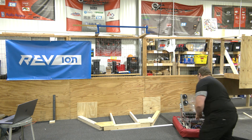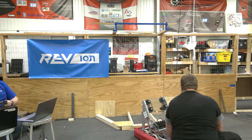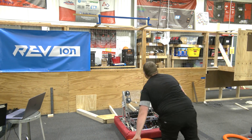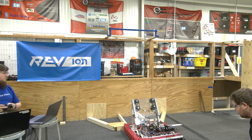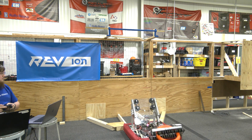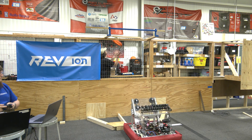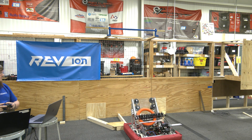So now we're going to move the robot to the front. We're still maintaining 60 percent shooter voltage. We found that this power across all sides of the subwoofer does just fine — clean shot. However, if we start moving the robot back and we decrease the power, something that we can do is loft notes in from further away. We'll show that in a second.